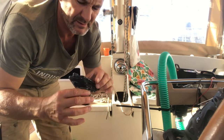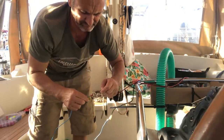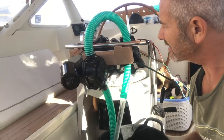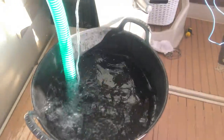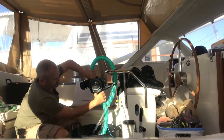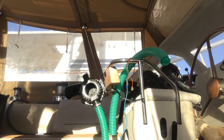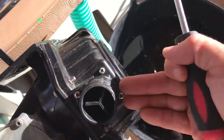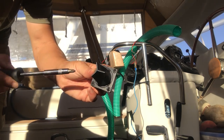I'm going to put this on the test pipe to try it out — the valve seems to be okay. It seems to be sucking a lot of air and there's the leak there. Those screw holes — they're not tight — so I need to get some Sikaflex in there to make an airtight seal. But at least it's pumping, which it wasn't doing before. I think these valves have been changed so often that the screw threads are no longer biting in, so it's not forming an airtight seal — there's water getting out and air probably getting in as well.